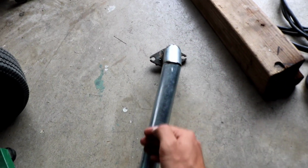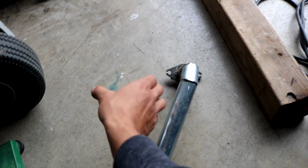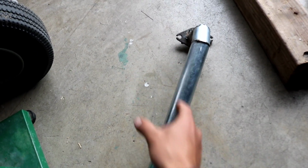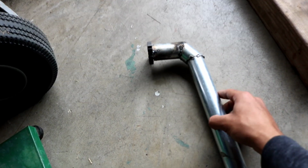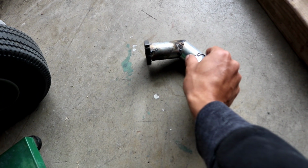But now it's too far angled this way. The actual exhaust of the truck, the turbo, is right here, so the exhaust goes straight down. Right now it's just an open downpipe, it ends right here, but I am going to be doing a full downpipe all the way down, so it's going to interfere with this. So what I'm thinking of doing is taking this off and shaving a little off right here, so instead of going back like that, it goes more forward.